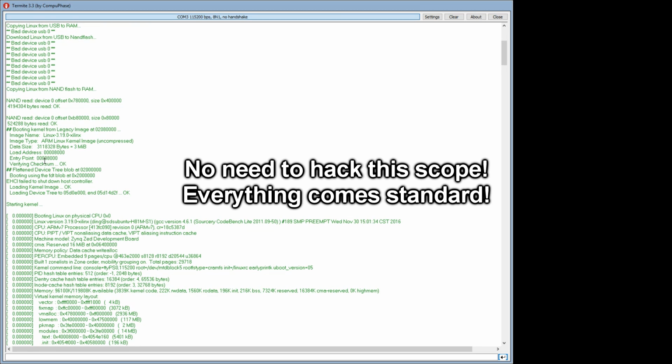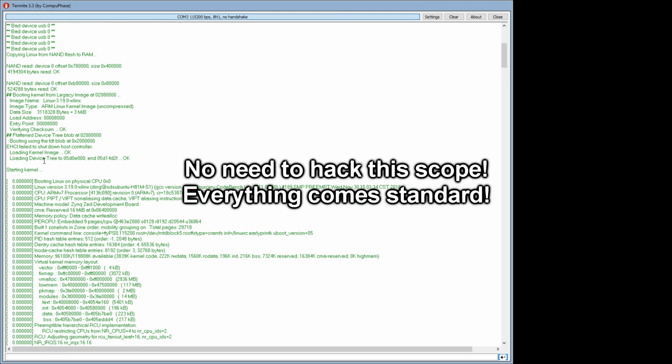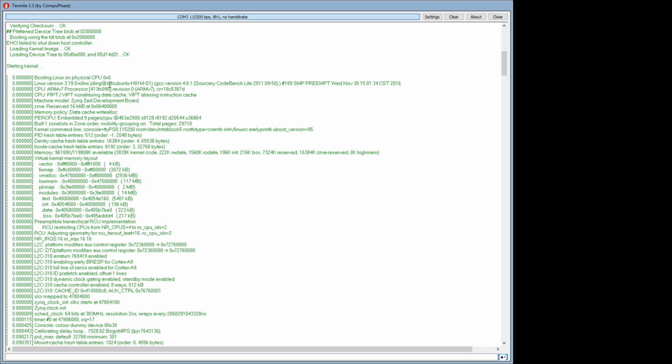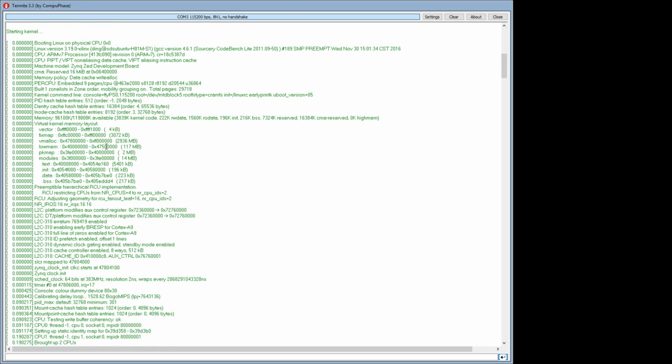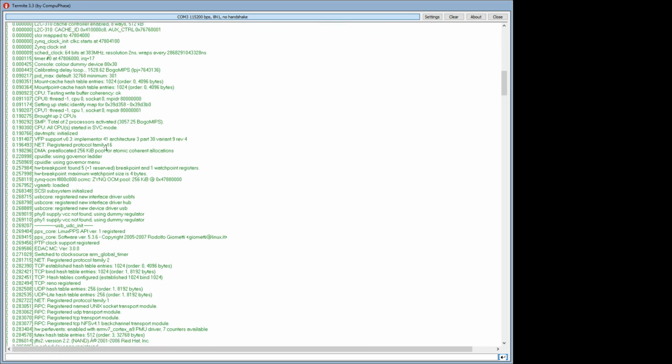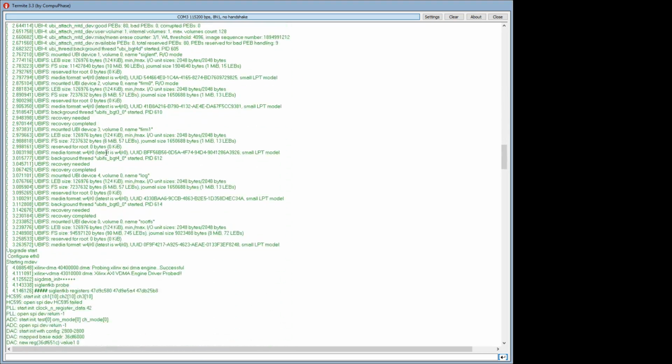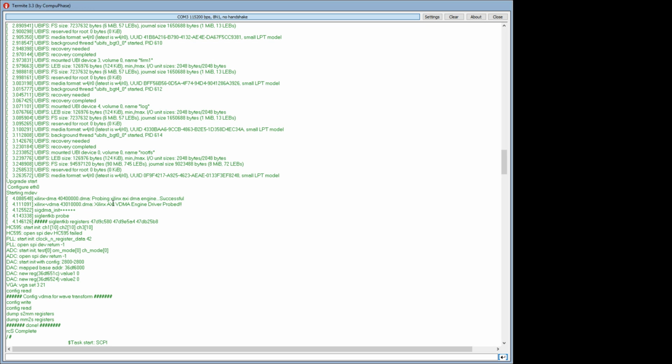This is not going to be a hacking video by any stretch. We just want to have a quick look: booting kernel, booting Linux on physical CPU, Linux version 3.19.0 for those playing along at home. GCC version, there you go. It's all happening. So, is there anything interesting? That's all the Linux boot stuff, USB, blah, blah, Xilinx AXI DMA engine successful. That'd be for dumping all the high speed data.